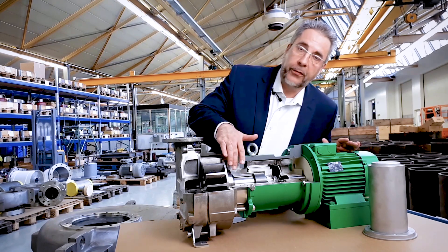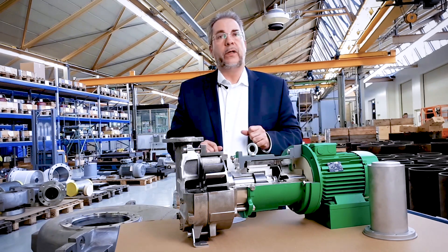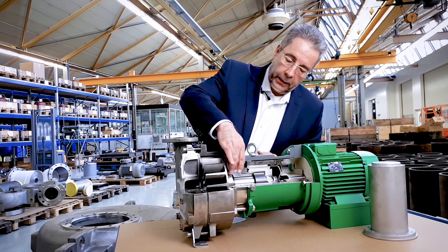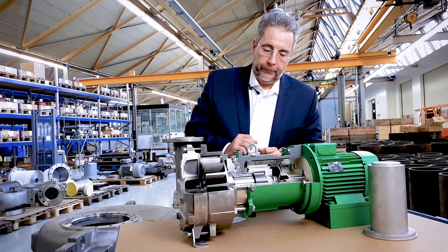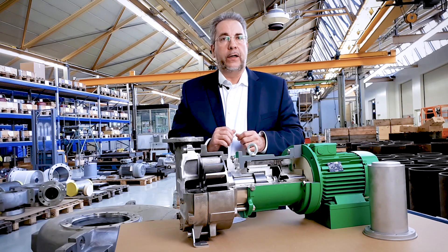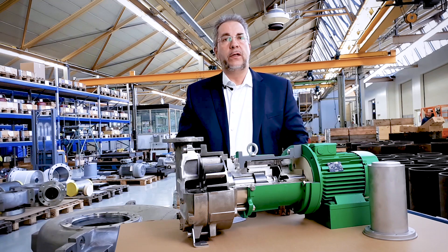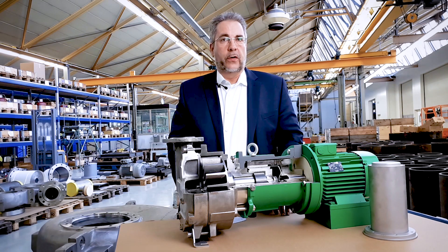The hydraulic part of the pump is equipped with a slide bearing. This slide bearing needs to be flushed and cooled by liquid. The liquid is taken from the hydraulic part of the pump and led through the shroud to flush and cool the slide bearing. This stream is also used to carry away the eddy current losses and the heat induced thereby. It needs to be continuously flowing, and therefore the magnetic driven pump requires a minimum flow, which is given in the instructions of the pump.